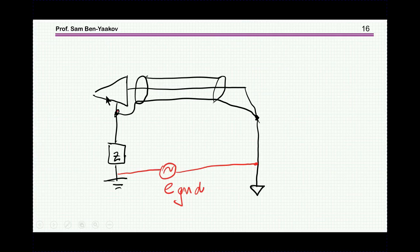There are oscilloscopes which are differential. I'm not dealing with it in this video. I'll discuss it in the next video or forthcoming video, the possibility of using a differential, either amplifier or probe. But a regular oscilloscope would have a single-ended input, meaning that there is one line and then there is ground. Now usually this ground is not connected directly to Earth or to the connection of ground, but rather through some impedance. So now we have a difference here between these two, and I'm shorting this and this.